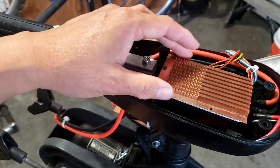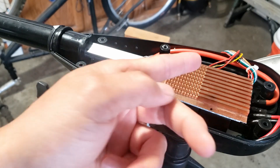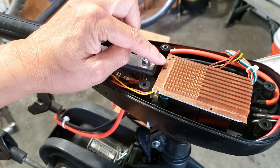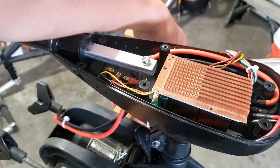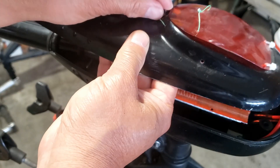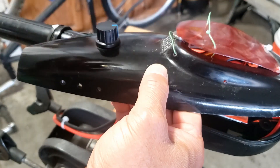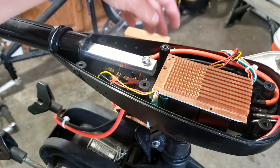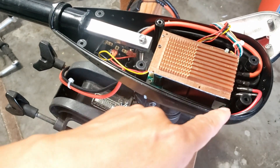This heat sink is an add-on — the PCB inside does not have one originally. I used heat sink tape to hold it down, and also have two little screws to hold it tight. In low speed it gets quite hot, which is why I have this little design here — I opened it up so in low speed there's some air circulating, going down into the housing to maintain the temperature. High speed is fine with the wind going through.